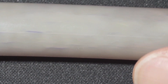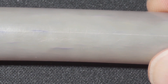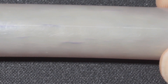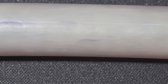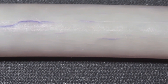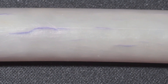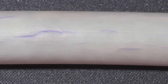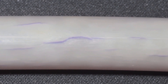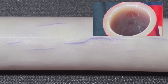I'm going to show you in the future documentation — the science of why that pipe fails. There are two different types of leaks. Type one is from the inside to the outside of the pipe. Anytime you have that kind of failure, if you examine the pipe in that area, you're going to find many, many cracks. It's just one of them gets to the surface first.